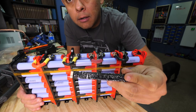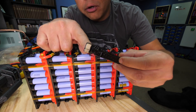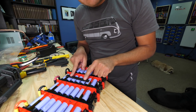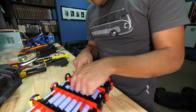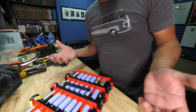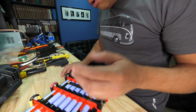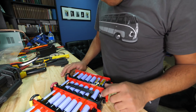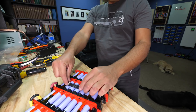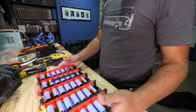Now that we've got our modules all wired up, it's time to install these — these are long-mons, the sensors for the BMS. They have a temperature sensor in the board, so it really helps to install them right next to, right on top of the batteries. That way if a module gets hot, the sensor picks it up and sends it to the main unit, saying to disconnect or lower the rate of energy transfer. There are a bunch of things you can schedule to happen in case of hot modules or when the temperature goes up a certain amount. I'm going to use double-sided tape to tape those on there — hopefully the double-sided tape will transfer the heat into the sensor.